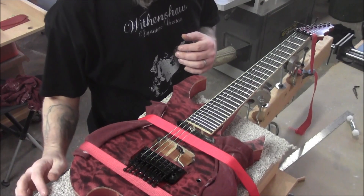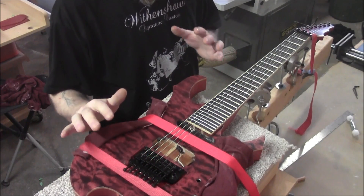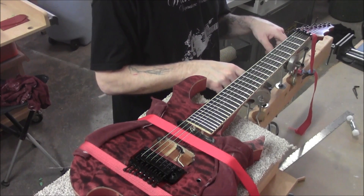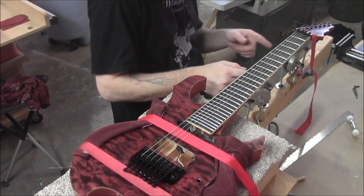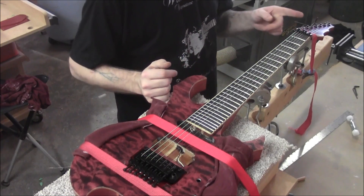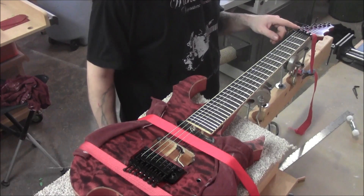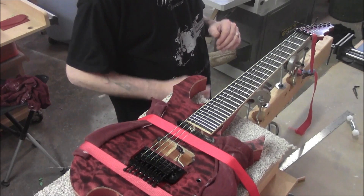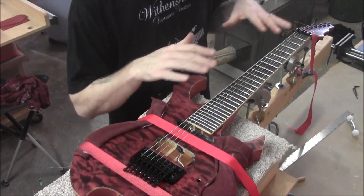We've got the instrument set up in the fret leveling jig, and you'll notice I've protected the body from these straps because you've really got to torque them down — you want to make sure there's no movement in the instrument at all, that it's nice and stable. We have two dial indicators here, and the plungers on them have to remain in the center of the back of the neck. We've also got to make sure this front plunger sits right about where the first fret is, and the nut area has to line up with this strap here. We also have our guides that we want centered on the neck.